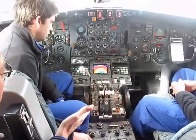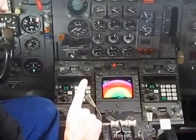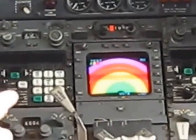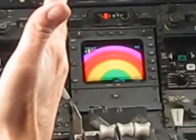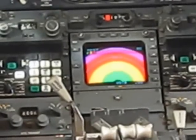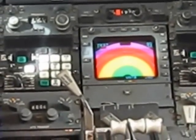You can actually feel the antenna zipping around. Notice that number going up and down — that was the tilt up and tilt down. We've gone through a test, and after a couple of seconds it'll go through a test, it'll transmit, and then it'll just stay in that mode. If there's a fail, it will come up with a fail. If it does come up with a fail, it should be a TR fail, because it's in the off mode.